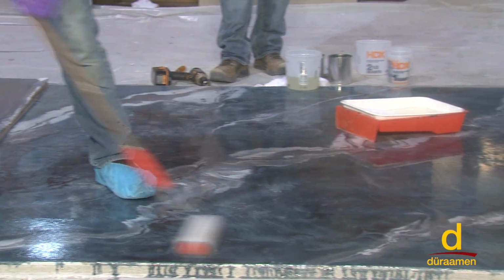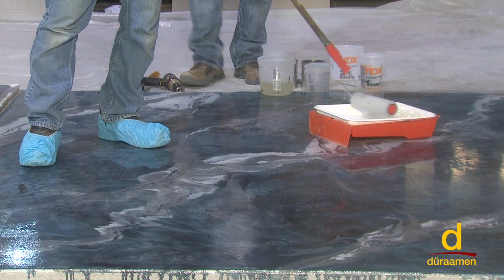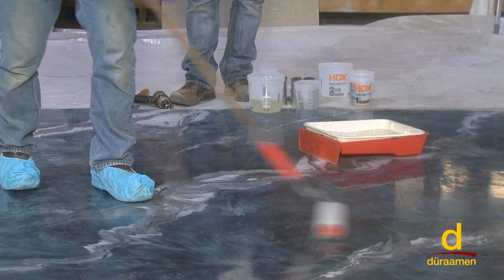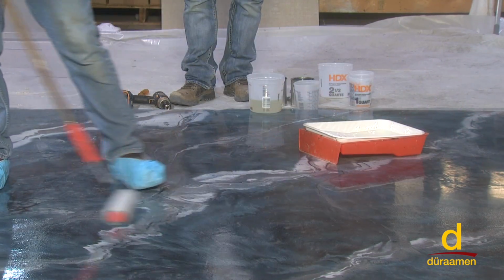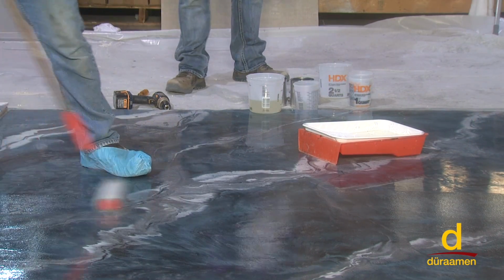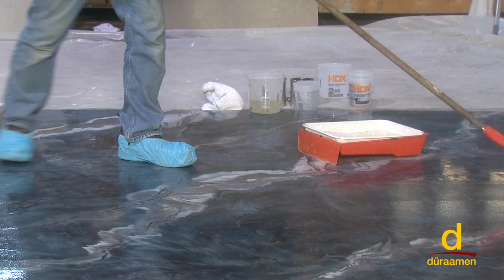You're right. So another general rolling tip, you'll watch professional guys that have rolled for a long time. This is about the perfect width. What they'll do is they'll load their roller up, they'll go right in the middle, one time up, one time back. That's about how much you need on your roller. Right here in the middle. If you don't put it on, when I say pretty thick, yes, but it won't lay down real nice. It'll orange peel, which most polyurethanes have a slight orange peel anyways.